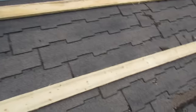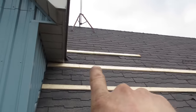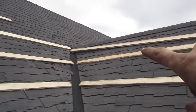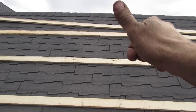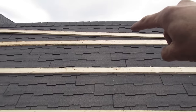I've got everything strapped nicely all the way up to the top. I didn't continue there because I want to double-check that we match up 100% on the other side. Also, that row of strapping ends up 8 inches down from the top, which is perfect for our ridge cap. I've got to pull the capping off and then nail that one.